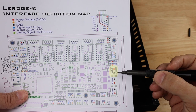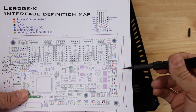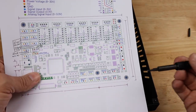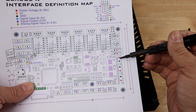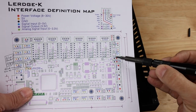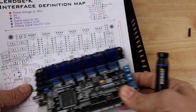Again, here on the hotbed, we have a power and a ground. But the only time that this will matter is if we're using an external MOSFET, just like what we have here. And so it will matter to us. But if this is going straight to a hotbed, then you can just disregard the power and ground here under most circumstances. Now right here, as we saw on our main board, this is our main power connector,